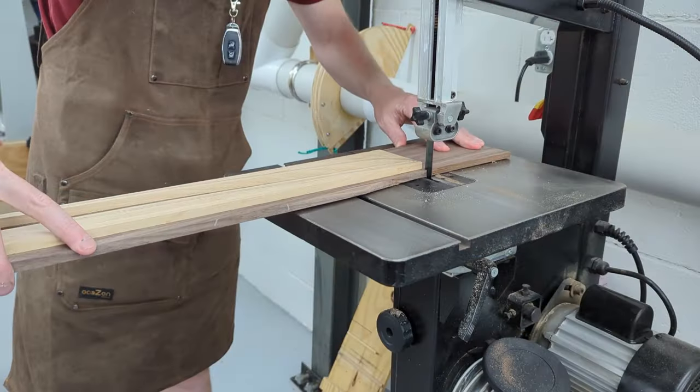I guess I kind of lied when I said the woodworking was done, but really, this is just using some epoxy, so is that even woodworking? I had nightmares of dripping epoxy onto the Ito I just painstakingly tied, so I covered up every single inch of it. To attach the Tsuka to the blade, I mix up some 5-minute epoxy and carefully fill the recess. I make sure to coat the sides, and I do my best to spread out the gloopy mixture inside of the Tsuka. After just a bit of procrastination, since I only have a 5-minute working time, I'm at the point of no return. The blade gets inserted into the Tsuka, and I wait, pretty impatiently, for the epoxy to cure.